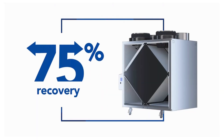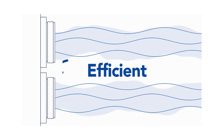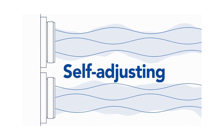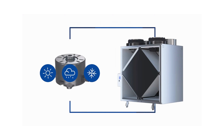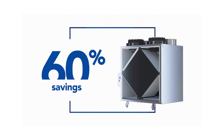The second major benefit is that as it's bringing fresh air in, it's treating that air. As the air comes through your home and goes through the core — let's say it's 30 degrees outside and 70 degrees inside — the Broan is up to 75% efficient as it transfers energy in the core. There's a 40 degree delta, so air coming in at 30 degrees rises up an additional 30 degrees to 60 degrees before going into your cold air return. Your furnace doesn't have to work as hard, which helps with its overall energy efficiency.